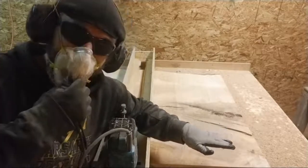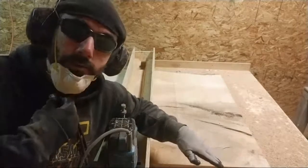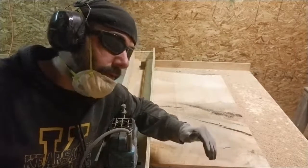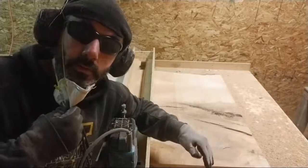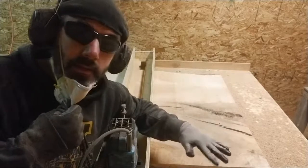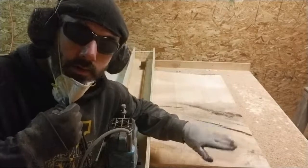But if you are dealing with people and customers and trying to educate people, try to mill them a little thicker. When they say, I need a 2-inch thick slab, usually they're looking for a finished slab that's that thick. So make sure you let them know. I would buy 2.5 inches. You're going to lose a half inch when you're flattening it and sanding it. Get it a little bit thicker, this way, when you're done, you can work it down to the 2 inches.